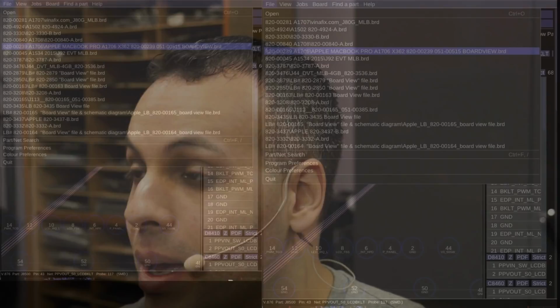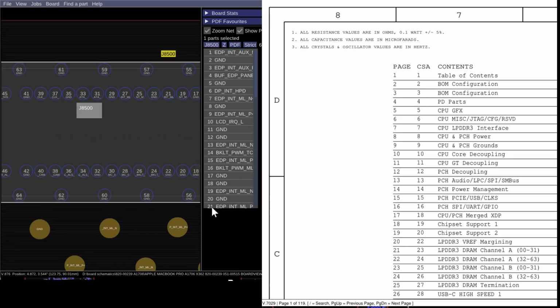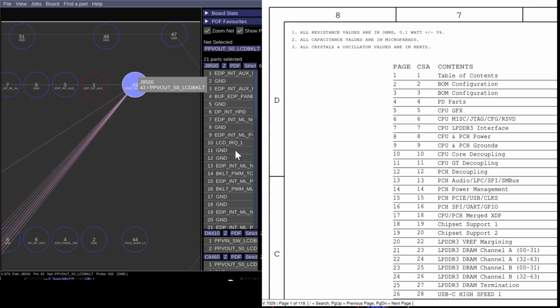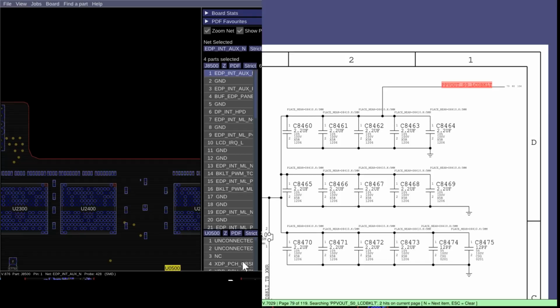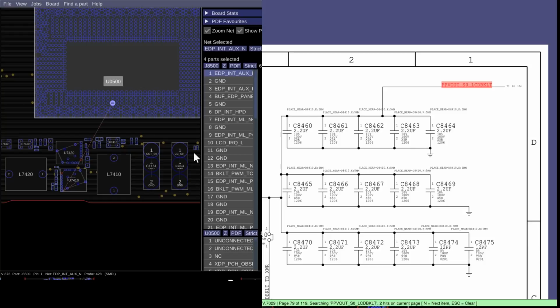Glad you asked. Let's check out what those look like on the schematic and board view over here. All right, so we're just going to take a look at the display connector over here. Same terrible, awful design. You have backlight line right next to display port line. And let's see where this goes to. Now remember, this only has one graphics chip, not two. So that display port line is going to go straight to the CPU. So what happens on this machine when there's any teeny tiny malfunction, any sort of thing that's going to make the voltage go from this pin over here to this pin over here? You send 40 volts straight to your CPU, and you destroy the CPU.